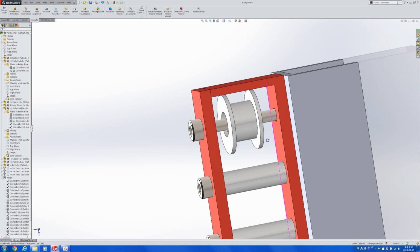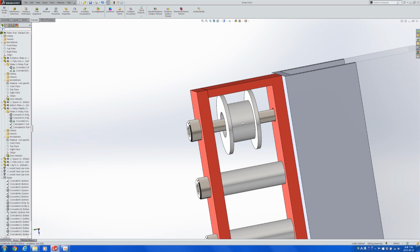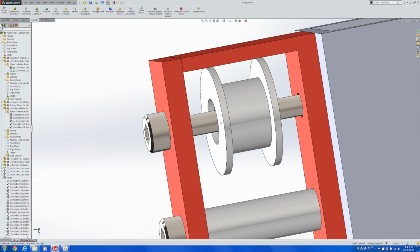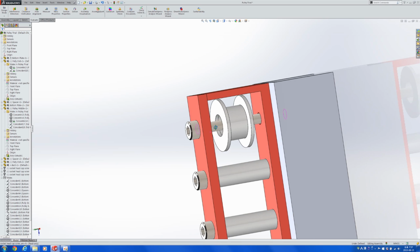What we need is a pair, or actually 3 or 4 bearings, that would make this pulley really smooth when it is rotating with a cable inside, as it is being used as the lift pulley. So some things to remember. This is an M3 bolt, which means the diameter of the bolt is 3 mm, and that means the bearings that we would end up using should have a 3 mm inside diameter, or in short ID. And the outside diameter should not be too much bigger.